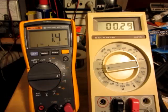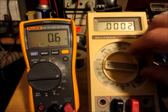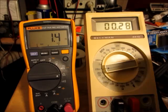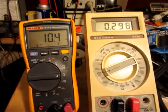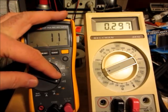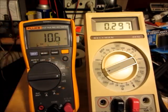The Fluke is in ohms mode, and I'm checking the current. That's showing 0.29 milliamps — 0.3 actually. So the Fluke is just using a fraction of a milliamp. In continuity mode it doesn't change. So I think that particular meter is nothing to worry about.